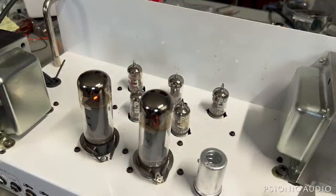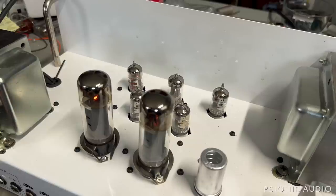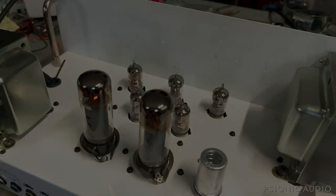And of course, a new volume pot and knob for the clean channel. I've already reached out to the Orange Amps distributor in Georgia, and they're sending me prices and availability for the replacement OEM pots. I could get by with a lot of different things for the clean channel on this one, but on the OR100 with that dual gang long split shaft, if they have it in stock it's better to do the OEM - and some new Orange knobs. I think both amps will have happy endings. Hopefully by the time this is uploaded I'll have had that reply email from Andrew at Orange Amps USA, and all will be well.